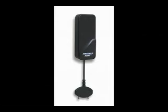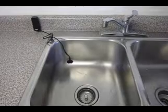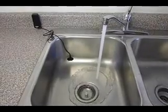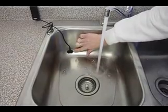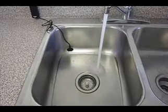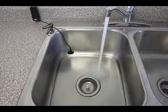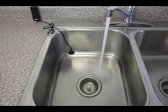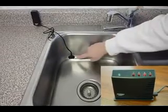The water alert sensor, model WA434TL. After you have finished programming the sensor to one of the zones, test the sensor in water to ensure it is communicating with the receiver. Dip it in water and just remove it. A clean surface will be required to mount the sensor securely. Place the transmitter and sensor portion to your desired location, but always remember to mount the transmitter portion at least 6 inches above the sensor. Once water is detected on the sensor portion, the main receiving unit will alert you.